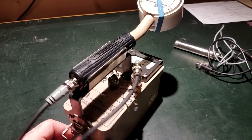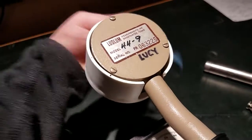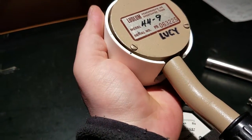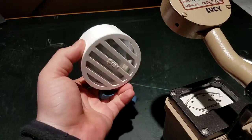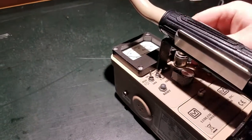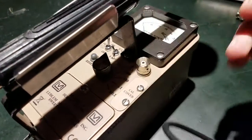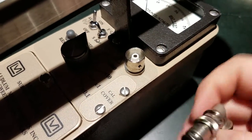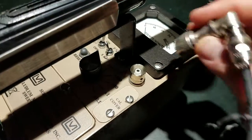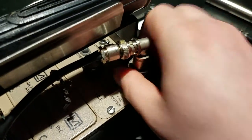This is also really nice for hunting antiques because it's got an alpha-sensitive Ludlum 44-9 probe. This is sort of a makeshift cap I made from a two-dollar drain fitting I found at the local hardware store. The instrument is set up for 900 volts. It has by default what's called a Ludlum C-type connector, and this is a right-angle to BNC adapter, because a lot of probes use BNC cables, so it's nice to have the BNC end available.